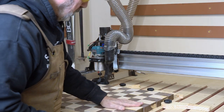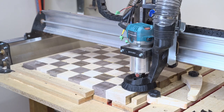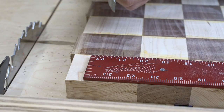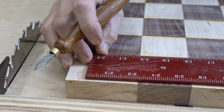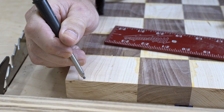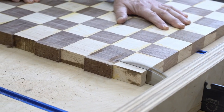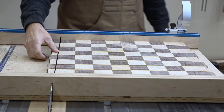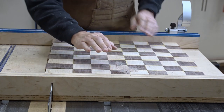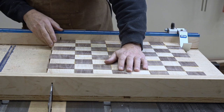This is pretty flat already, so I'm not going to have to go down too far. I'm going to use this inch and an eighth surfacing bit from Amana. I don't use this very often, but this is the time when I need it. Two and a quarter would be right up there - that's where I need to cut and that's really hard to see. I'll sneak up on that mark. Now I'll flip it over - I should be able to set my stop at 18 and have a perfect two and a quarter inch square.